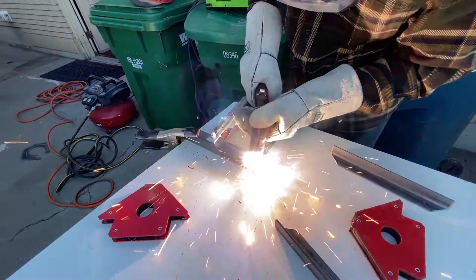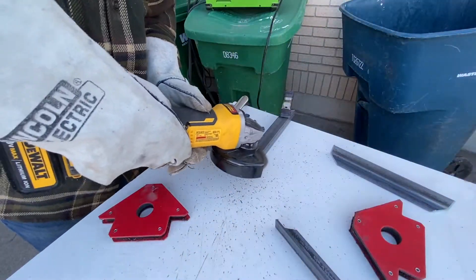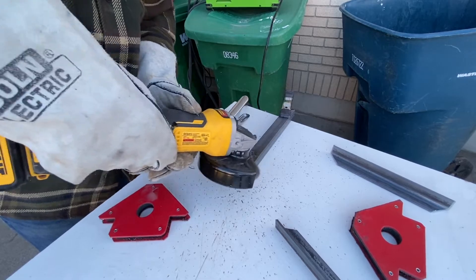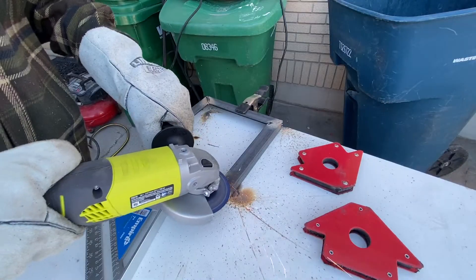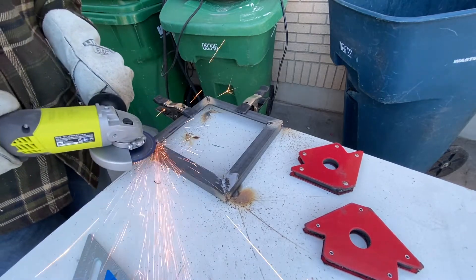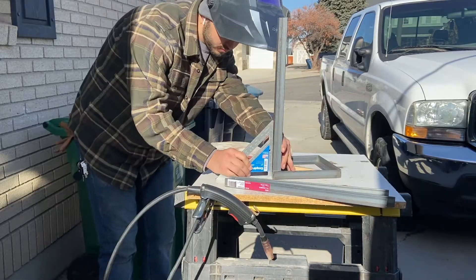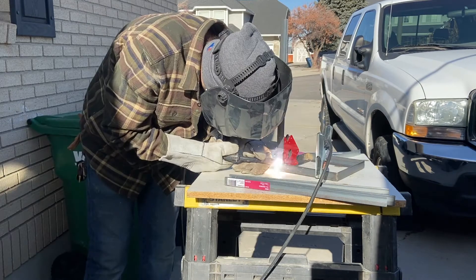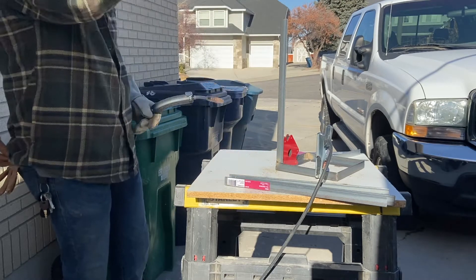The smart thing to do when you're welding is to tack pieces together before running longer beads. Tacking means you weld a tiny spot, make sure things are square, and then run a full long joint — that way you can adjust stuff before it's literally fused together. I did not do this, but that's how you learn.